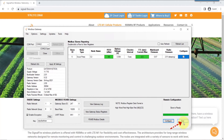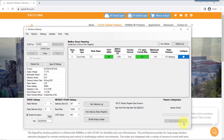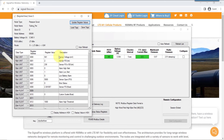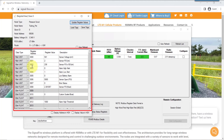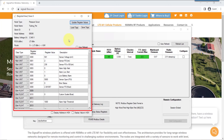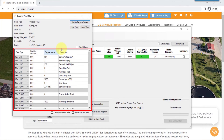End the session by clicking the end button. If you forget, don't worry — after 10 minutes the session will time out on its own and return to its normal state. By double-clicking on the node, you can validate all the Modbus registers and their respective values, which is quite useful for system integration folks who need to know the registers of the pressure scout.